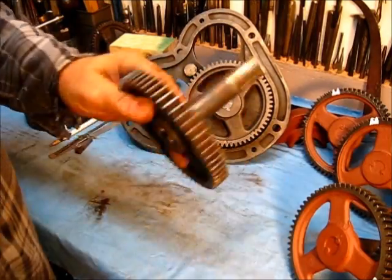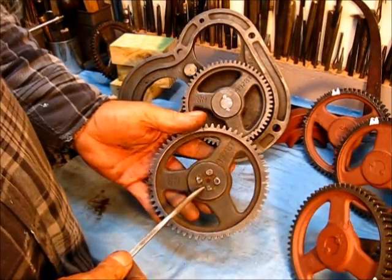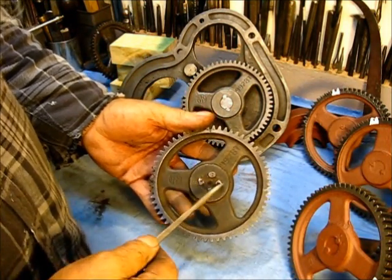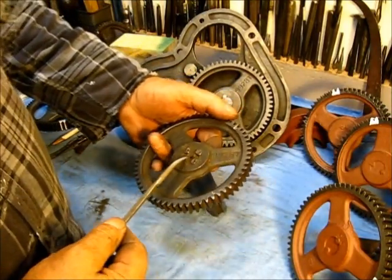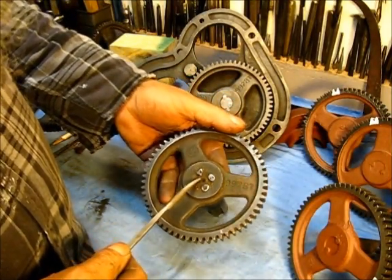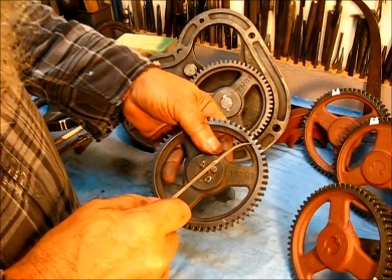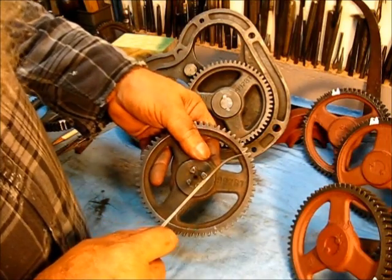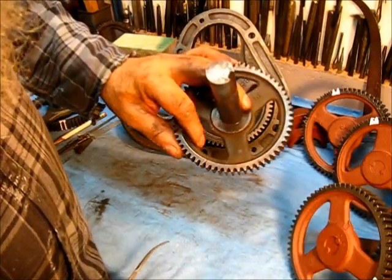This right here is a replaced shaft, as affirmed by it having four locking pins in there — they look like straight pins driven in. You'll find this kind of marking quite often where there are two factory markings and then someone has taken a file, filed a V right in between them, and on the opposite side filed another V.